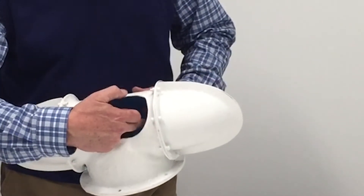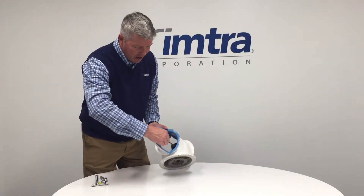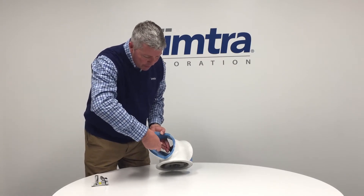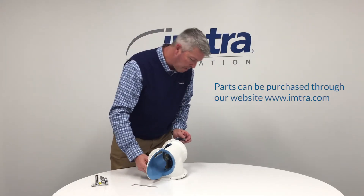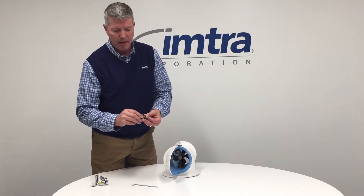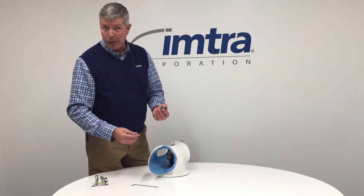On this particular model, your anode is on the opposite side of your prop. With our 4 mm Allen key, we're going to remove our retaining screw. When you're replacing this, obviously once a year you want to replace your anode — it's usually going to be eroded away.